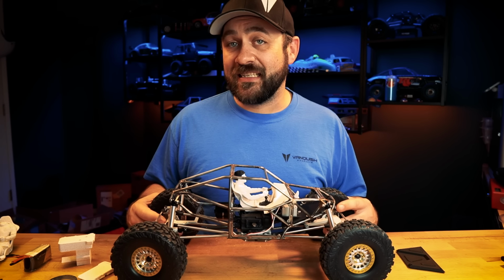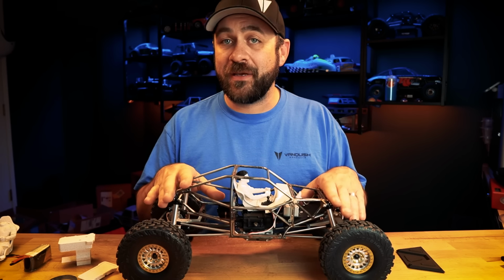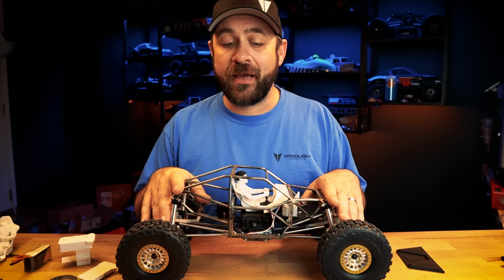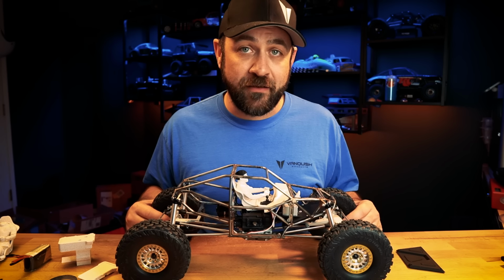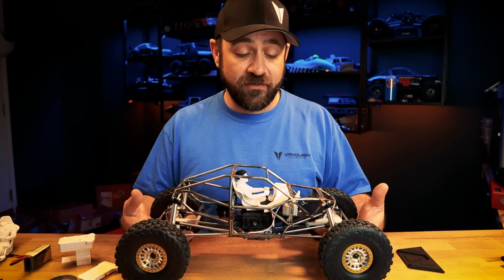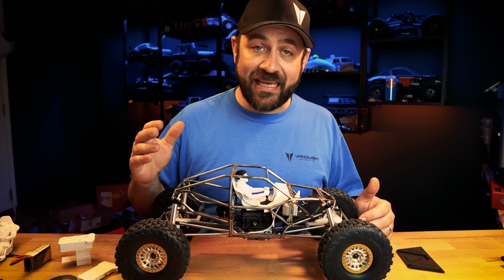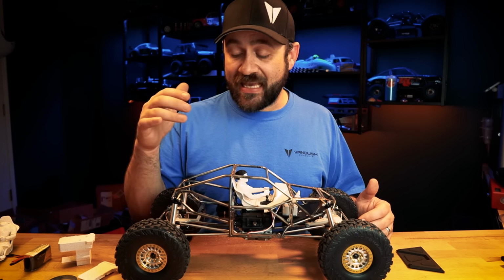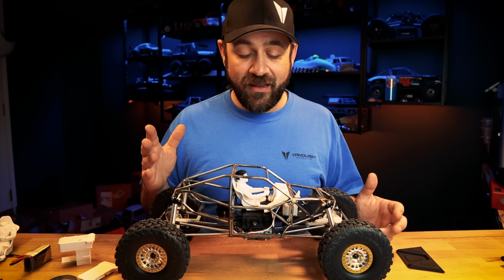One thing about this is that the end weight of this vehicle, RTR, for the event has to be a minimum of 7 pounds. Currently, how this truck sits right now is 4.95 pounds. Now, it's very incomplete. I don't have the steering servos in there, panels, ESC, BEC, battery, the scale engine, any details, none of that is in there.